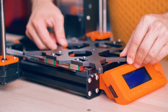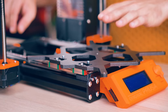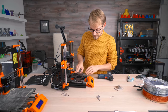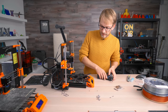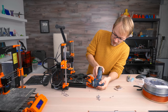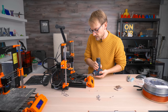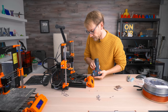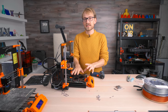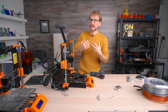So this is all mounted now but not tightened up yet, so it can still comply to exactly where it needs to be. The top screws are the ones getting tightened last — we're going to start with the ones at the front and back that mount the linear rail adaption block to the frame. You always need to keep testing whether everything still runs smoothly, and if it doesn't you can correct. This is a totally super rigid system — as soon as this is tightened up, there is zero compliance, zero room for inaccuracies anymore.